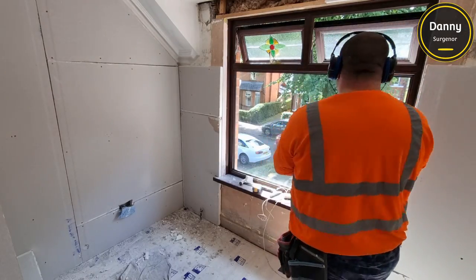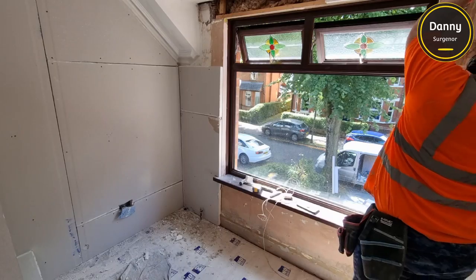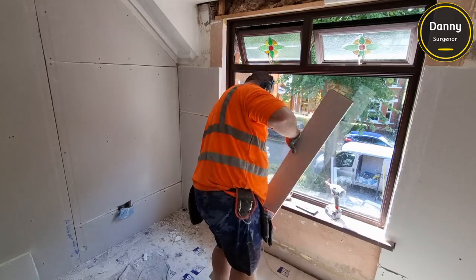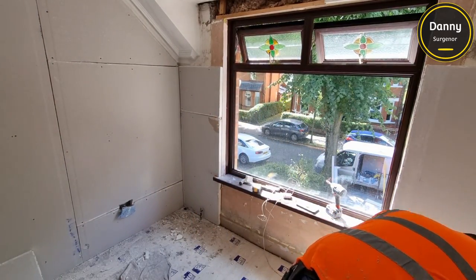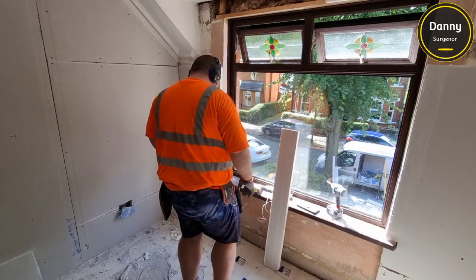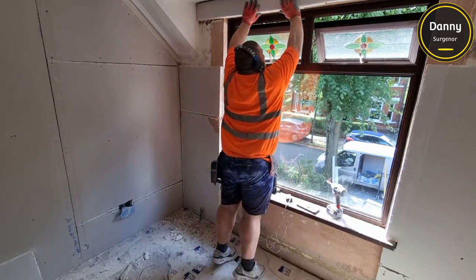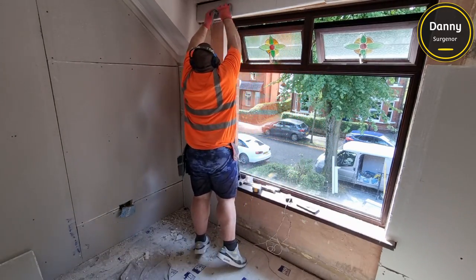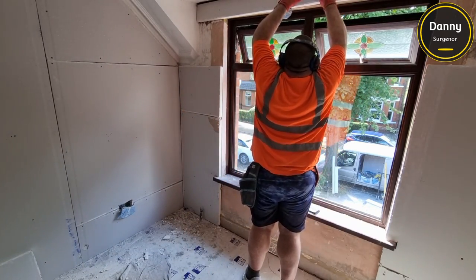When I finished skimming, it took me about 35 minutes to clean up. All I had to do was lift my tools out, lift the plastic, brush it out into the hallway - which was also all covered with the plastic. Roll the dust into a ball inside the plastic, roll the ball down the stairs collecting the carpet cover as you go, and you're left with a big ball of carpet cover containing all the dust and shavings. It makes life a hundred times easier, so give that a go next time you're skimming, especially if you're upstairs.